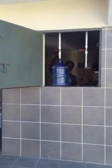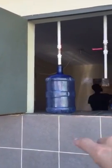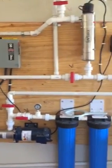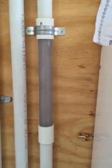They decided they didn't need a chlorine removal system because there's no chlorine in the local water supply, and they also didn't need a sand filter up top. If you're coming up to the station from outside, here's what you see. She's going to fill this bottle with treated water which she can then buy and bring home to her family. Jonas is going to turn on the system. It's good because right now the system isn't even running but we have treated water in the reservoir, so the water you're seeing has already been treated. Now it turns on the pump — you can hear it running — and after just a little bit you'll be able to see it flowing through the system. That's water running through the ozone treatment system. Once you do all the filtration, you have to do a chemical treatment — that's what the ozone treatment is.